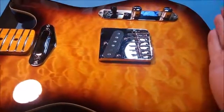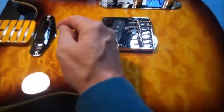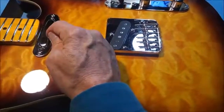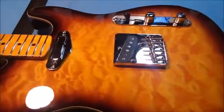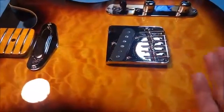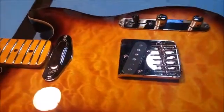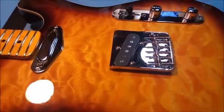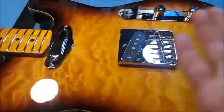But I did read something somewhere that said you need to make sure that the cover of this thing is grounded as well on the neck pickup. So bring that to ground, and because they were noiseless pickups, I figured, well, I don't need to do that because that's for non-noiseless pickups. And I haven't experienced it on tele number 1 as of yet, but I am going to go back and check it, and if it needs this, I'm going to do the same thing.